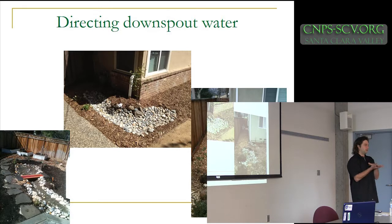So you put a little bit of DG, a little bit of sand, base rock, and put that right on top of it. And the cool thing is usually when you have the redwood, when we're doing the steps, we usually have some leftover DG or base rock from some other part of the project and just use a little bit of that for the stepping stone. And you can get reused base rock too. And reused base rock is just old broken up concrete. So using one more reused material.